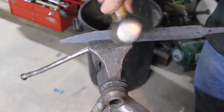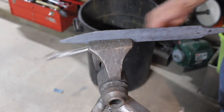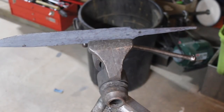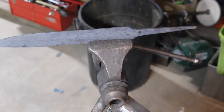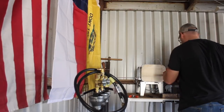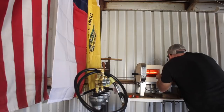So those two reasons make a lot of sense to me as a bladesmith as to why they all had hidden or tapered tangs. I did a quick forge normalizing cycle there — the blade's still pretty hot at this point, but the wrought iron was giving me a little bit of trouble. As the blade cooled down I was finally able to get our Damascus and wrought iron to cooperate and end up with a nice, pretty straight blade. It took a little fiddling and fussing, knocking stuff around a little bit, but everything held together just fine.